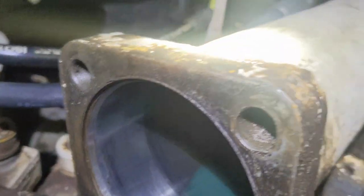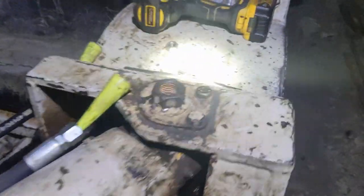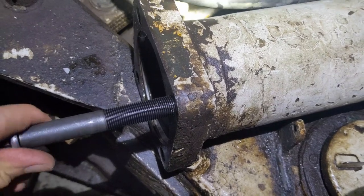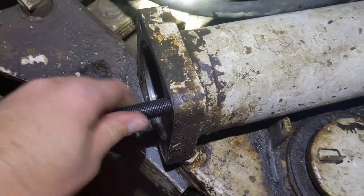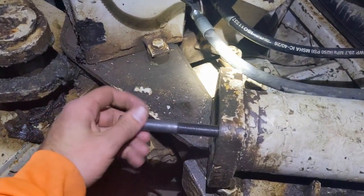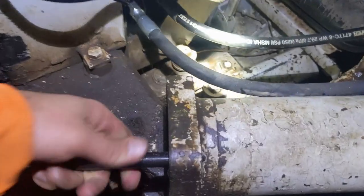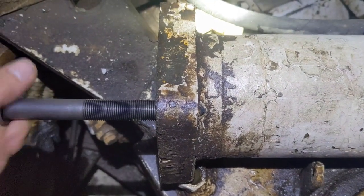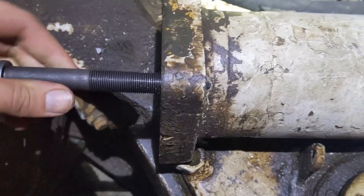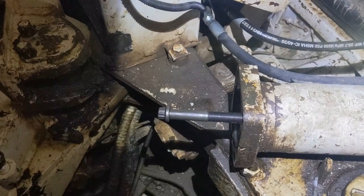What we've got here is a whole lot of damaged threads in this hole. They are damaged well beyond what a tap is going to be able to bring back. So we managed to track down some very long, overly long bolts. I'm going to try to use one of the bolts like a tap. I don't have an actual tap — it's on order, but Amazon screwed up, so no tap. Try to use a consumable bolt. What I am hoping to do is blow this out long enough to allow the installation of a backing nut — kind of like our hillbilly fix that got this machine back up to this level in the first place. Put a backing nut on it, achieve proper clamping force that way. Cross our fingers. Hope that it all works. We get enough clamping force, throw the new O-ring on the piston. Did I mention cross our fingers?